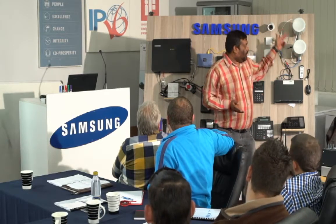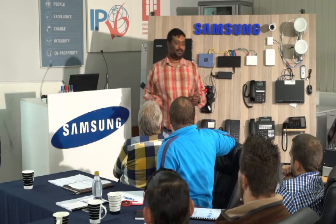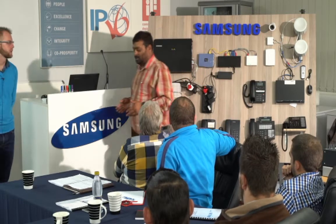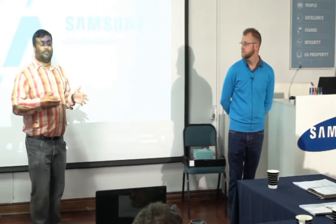Okay. Cable that goes to it. This is an outdoor unit. Outdoor cable, please. If you can, a shielded Cat 5 as opposed to an unshielded. But even an unshielded outdoor cable will be fine. Do not run an indoor cable to it. It's not going to work. Well, it is going to work, but it's going to stuff up quite quickly.